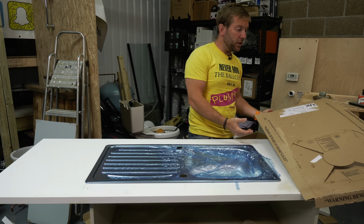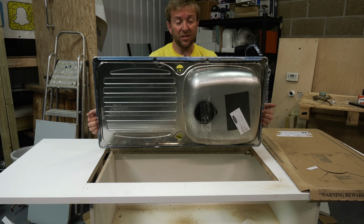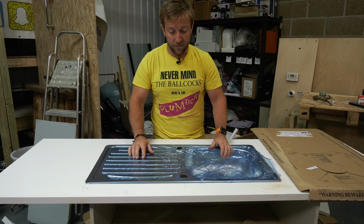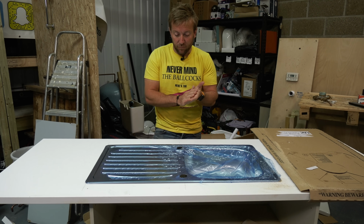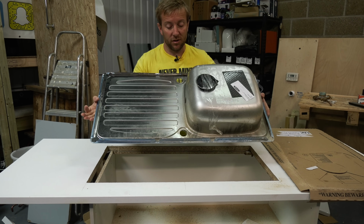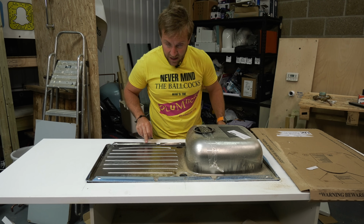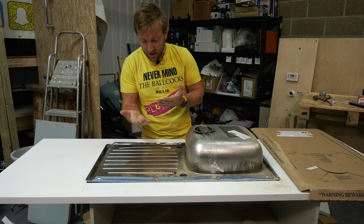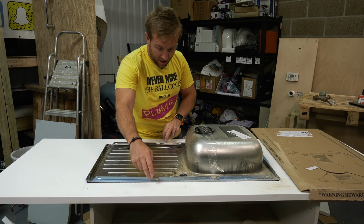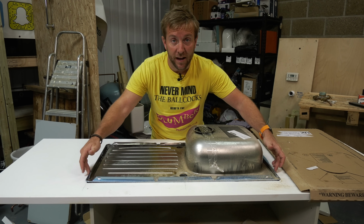Now, I haven't used this. Remember what I said about measuring when we're measuring. I don't know what's happened to this sink, especially ones that aren't very expensive, in transit, and you're only going to know roughly what size it is if you just measure those internals. It's so important. People just don't do it. You measure those internals like we did, from this ridge here to this ridge here, and believe me, you'll get cut doing it. I got cut. Sometimes it's a good idea to wear gloves. So, this ridge here to this ridge here, not the outer flange to outer flange.